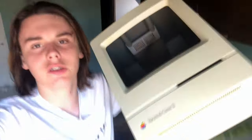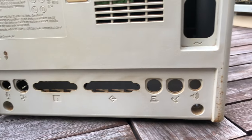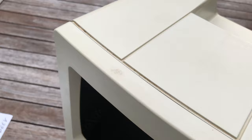So now that that is ready, I mainly want to focus on the case pieces and get them ready for retrobrite. Now it's time to get rid of those poo, I mean brown stains. I used normal dish soap, hot water, glass cleaner, and a toothbrush for the vents, speaker holes, and small case details.